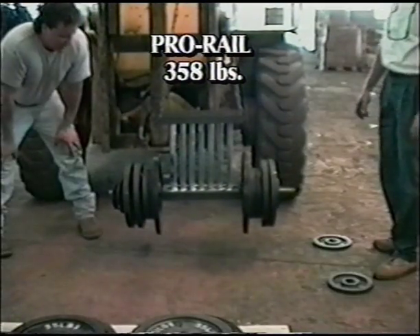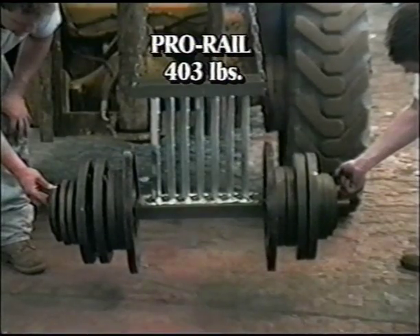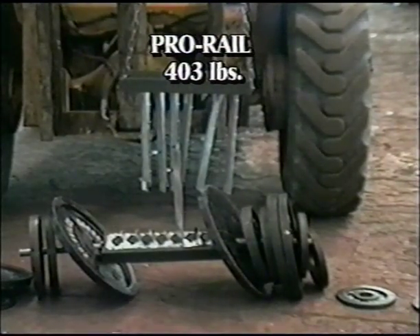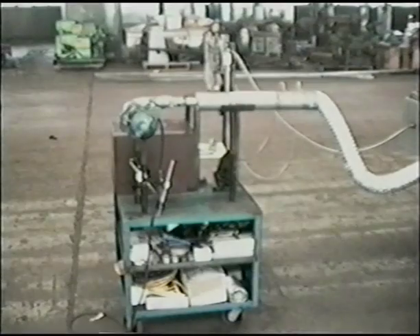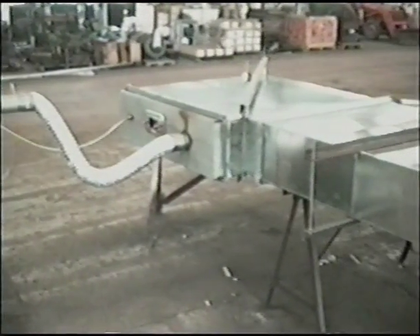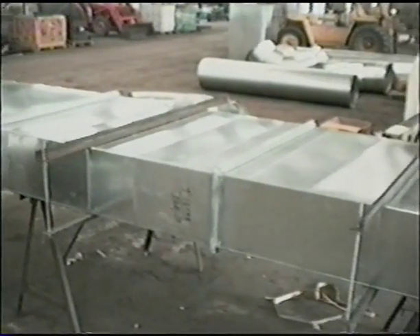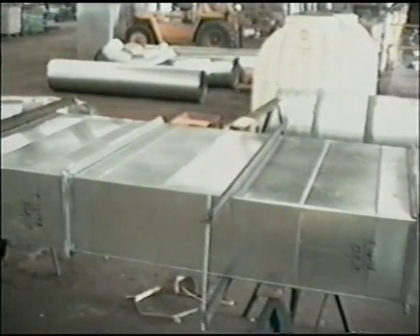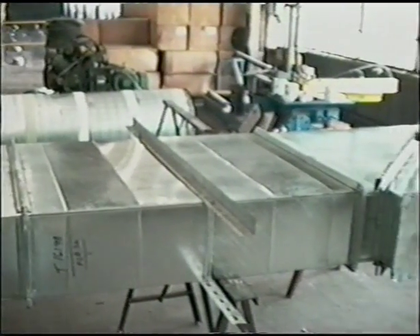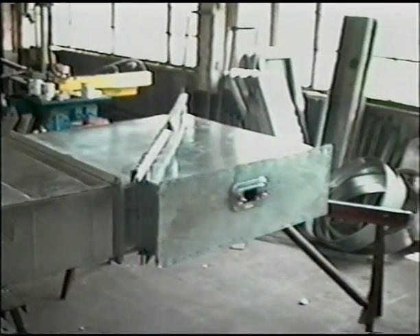The force needed to pull out the tabs of the ProRail was much higher than the forces which might be encountered in the duct system. Therefore, the vanes of the ProRail do not need mechanical fasteners or welds to hold them to the rail. To further illustrate the strength of the ProRail system, an in-duct static pressure test was performed. The test setup consisted of a fan and manometer to pressurize and measure the pressure in the duct, an elbow with ProRail installed in the normal manner, three sections of straight ductwork connected with DuctMate flange, and a second elbow in which the leading competitor's vane and rail system was installed.